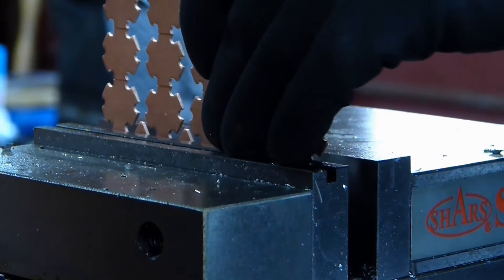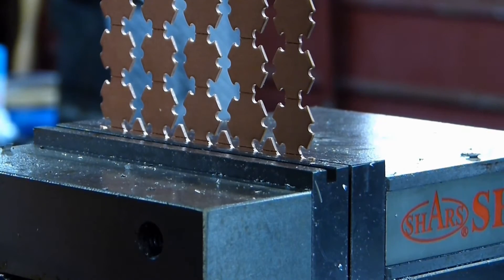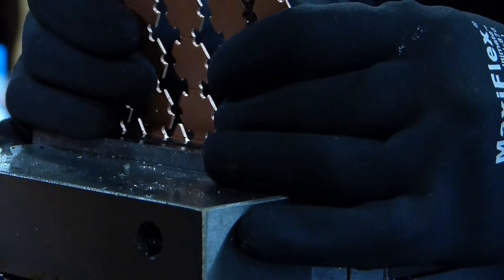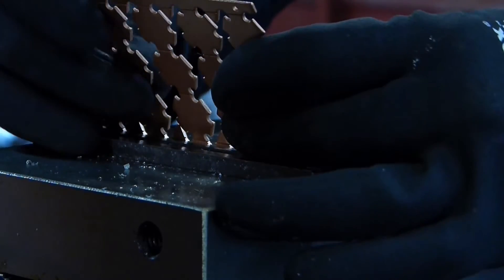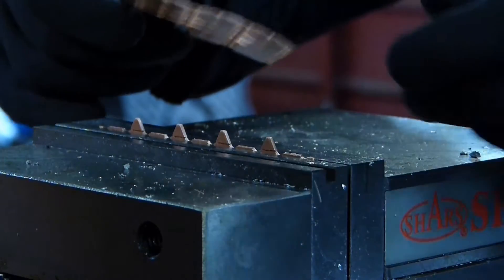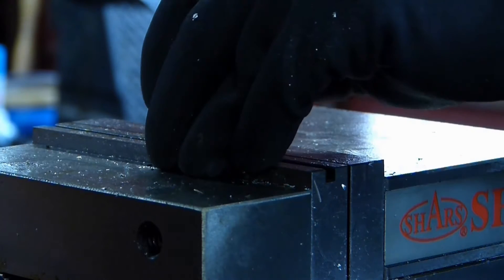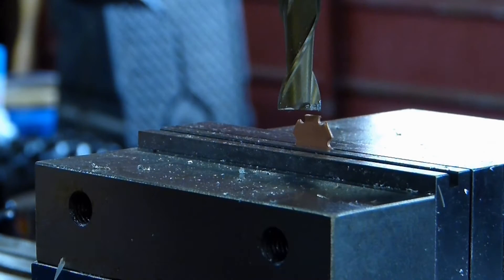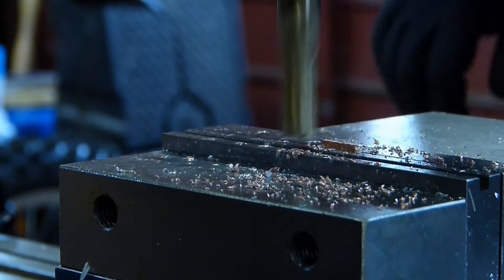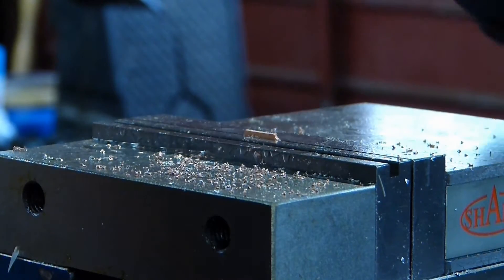Let's take a closer look at one of these sink pad stars and see how it's made. We'll fatigue a group of these off that support bar on the bottom of the package — just bend it back and forth until it fatigues and breaks off. Then we'll fatigue a single one, fixture it in the vice, and cut down to basically the sink pad surface so we can see inside. I used some WD-40 and a high-speed steel end mill cutter — no issues there.